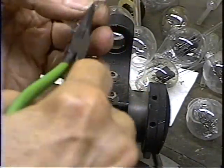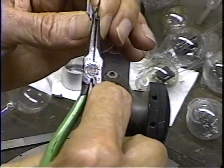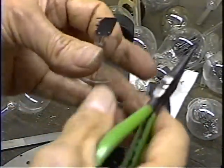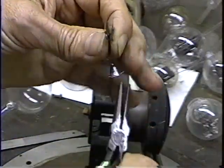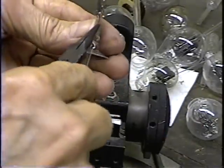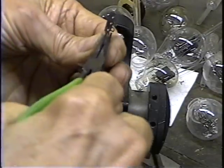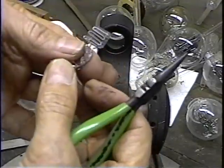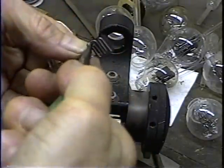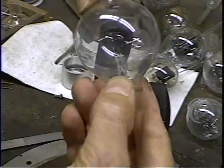The next thing we do is very carefully — being careful not to put stress on the glass — I'm going to keep my thumbnail pushed firmly against the wire when I'm bending it into place so that I don't put force on that glass. I'm going to work it up very carefully; we don't want to crack the glass at this point. That gets the plate sticking straight up. The grid's a little bit at an angle, so I'll just bend it over and bring it vertical. There we have our grid and our plate — it's a little bit low, so I'll open that grid up a little bit. That gives us our grid and our plate, and that'll sit up inside there like that.